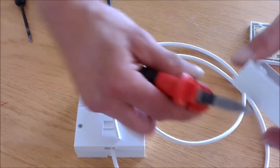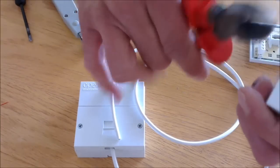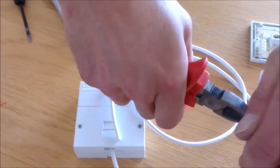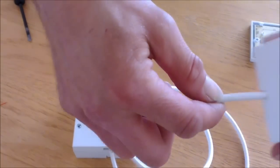You will need to break out a tiny section of the socket. Most back boxes come with a small breakout that you can use with a small pair of cutters to make a little hole in the bottom. Pass the cable into the socket